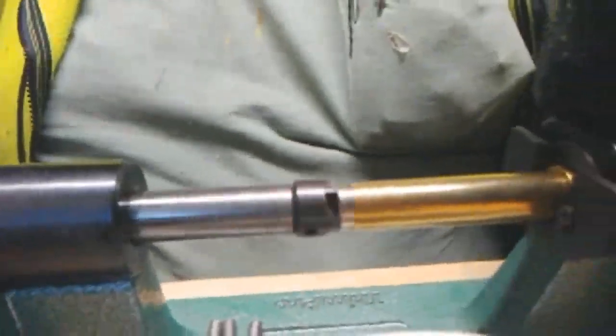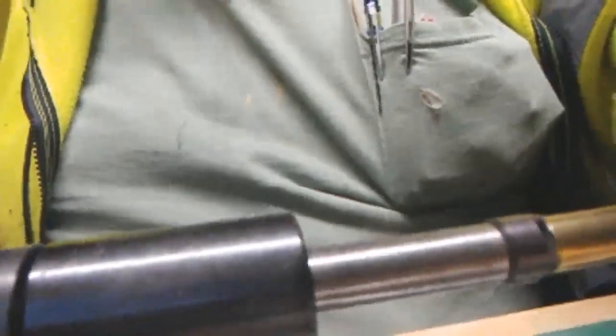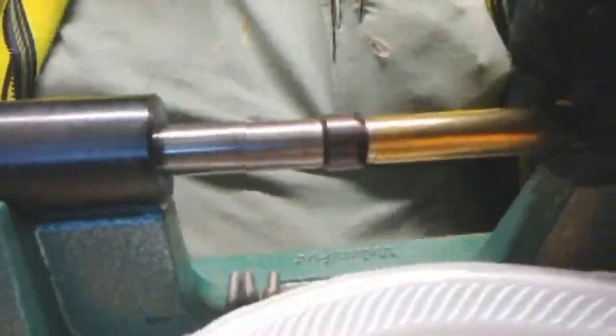Guess what I did? I went the wrong way. It's gonna go back. I'm gonna push that whole collar system towards the motor when you're shortening these up. Okay, so that's gonna be closed, but I got a small gap right there between my main collar and that trimmer itself. What I'll do is I'll stop that and move that forward just a little bit. I like to have my fine collar set now about halfway. That way I've got plenty of adjustment on the other end. Either way.